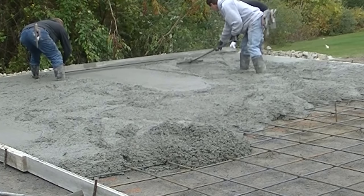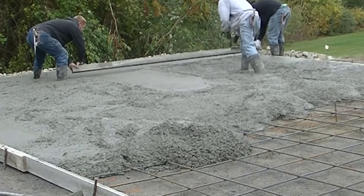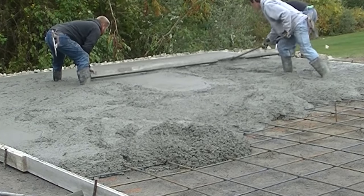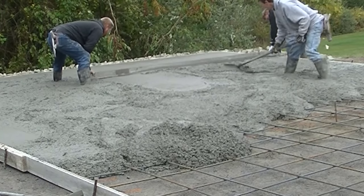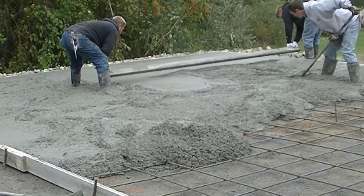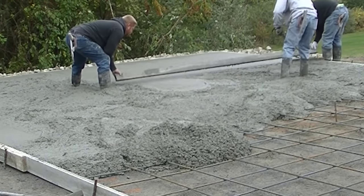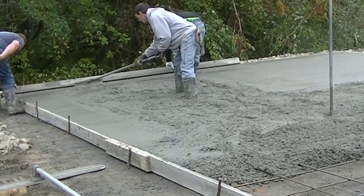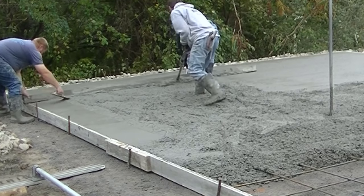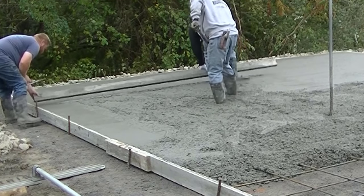We mag float the concrete around the grade stake and pull it out - that gives us our grade in the middle. We'll get that pad struck and that's what we use to level the slab. We've got a long enough screed board so both guys can get right on the outside of the pads, and then my job is just to make sure I keep the concrete from getting low. If it gets too high, I'll pull it down a little bit - you always want to be pulling back a little bit. That makes sure there's no dips in the slab. Luke in the middle is making sure when he screeds, going about six or eight inches with each stroke, he's making contact with the slab every single time. You can tell by looking at the outside of the screed whether you're making contact or not.